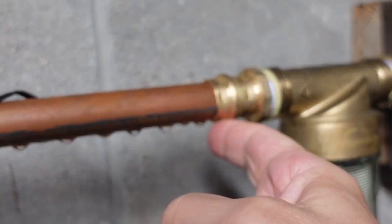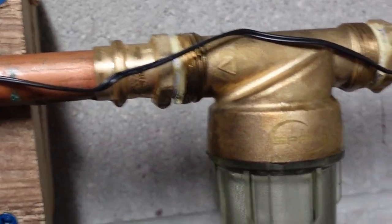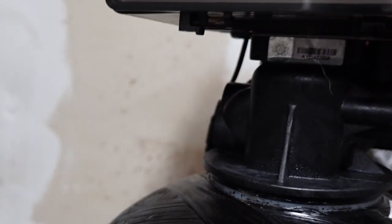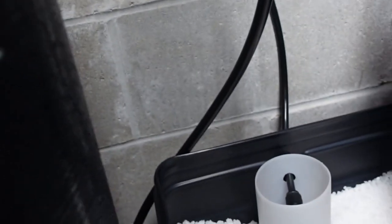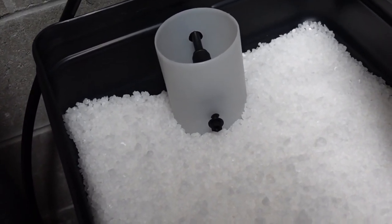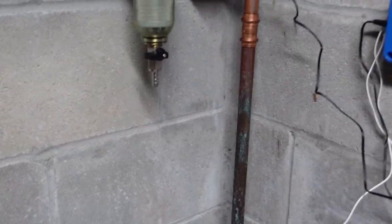Taking a quick look at the water system, you can see how humid it is. Condensation is forming all over the cold water. These are looking really good — they're pretty clear. There's nothing hanging in the bottom. This has already been through one cleaning cycle. They did refill the salt. It looks like it goes through probably almost a full bag of salt every time it runs a cycle, which is 2,000 gallons, about once a week or a little bit longer. So it's not too bad — I just have to get more salt, which is kind of a normal thing when you have a water softener.